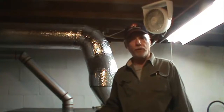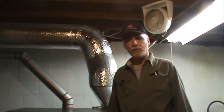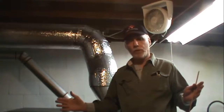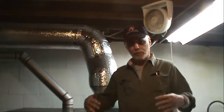The other issue is the opening for your cold air return — the dimensions are 10 inches by about 20 inches, which is only 200 square inches of intake. On my particular cold air return, I've got a furnace filter of 14 by 25, which is 350 square inches. So you can see the first filter is open with more than enough air coming in, but it's necking down going into the cold air return on the 8500, and therefore the blowers just can't pull that area.